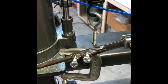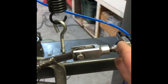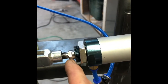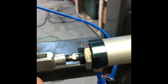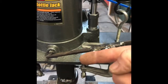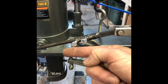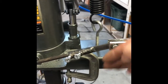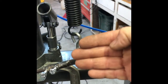I didn't go all the way closed — I actually moved this bracket out some because I wanted more adjustability. You can see it can screw all the way in, but I screwed it out so I could adjust either direction if needed. When I first put this together the lever was actually parallel to the horizon and the ram was closing it further — going down instead of up — so I lengthened this out to get it a little bit higher so it moves the right way.